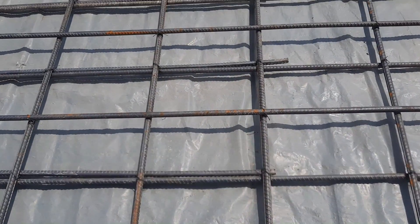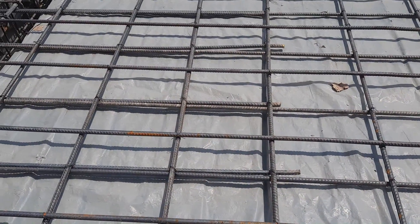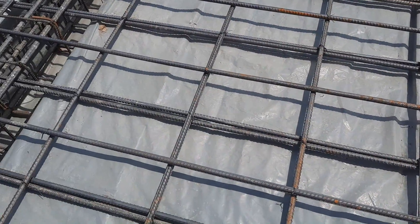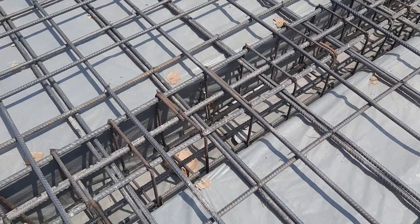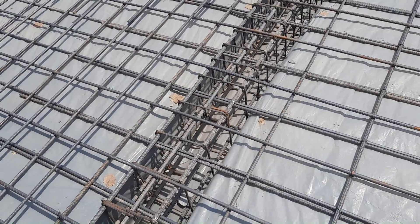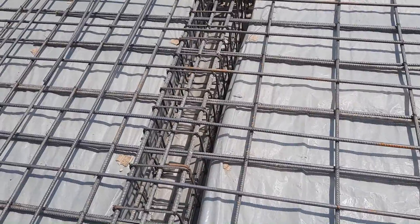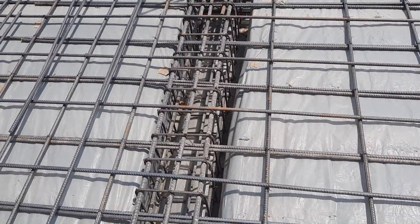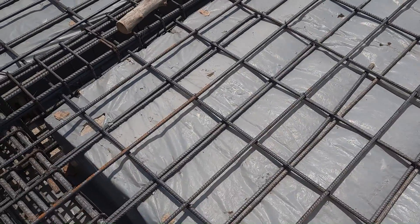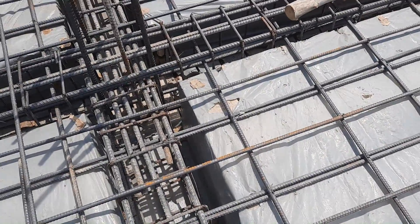You can see clearly a distance of five inches. To resist negative bending moment, we provide a crank bar or bent-up bar at a distance of L/4.